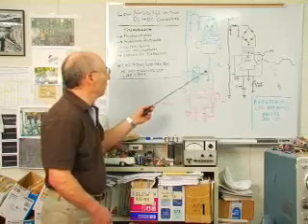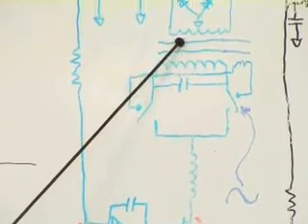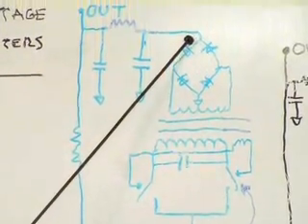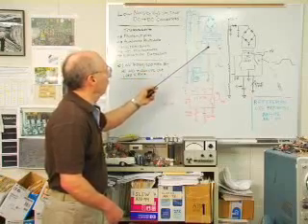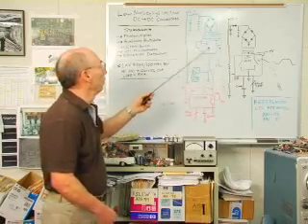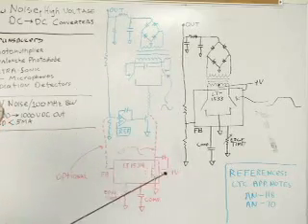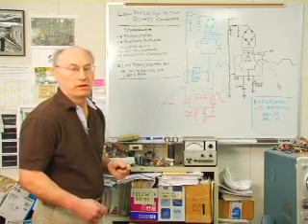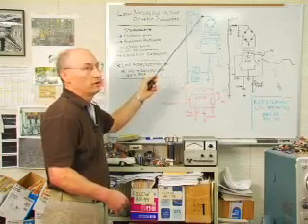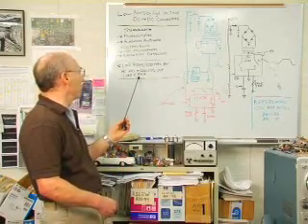One way to do the converter is to build a resonant sine wave producing power stage, which drives an output stage, runs through a two-section filter, feeds back to control the current through the sine wave resonant converter. You'll notice I've used a resistor here in the filter network instead of an inductor. The fundamental reason is I can get away with a resistor because at 100 to 1,000 volts out, a couple of volts drop is no big deal. The resistor has much lower shunt capacitance across it than an inductor would, making a much better filter — and you can get away with that because the load currents are so small.